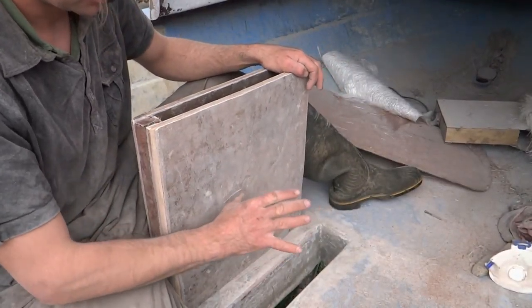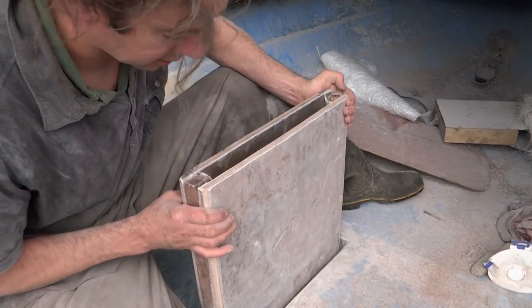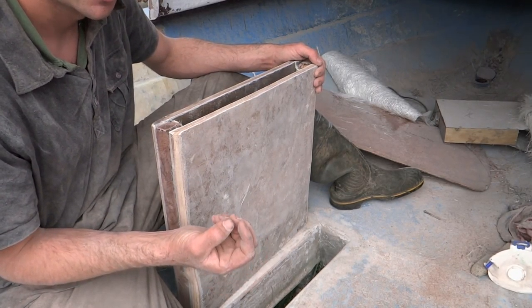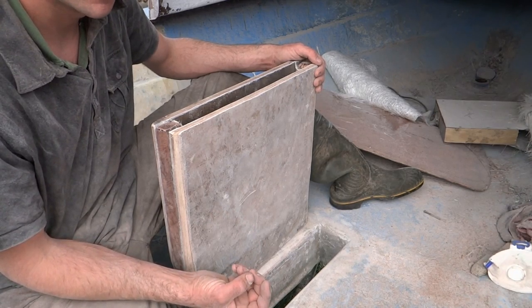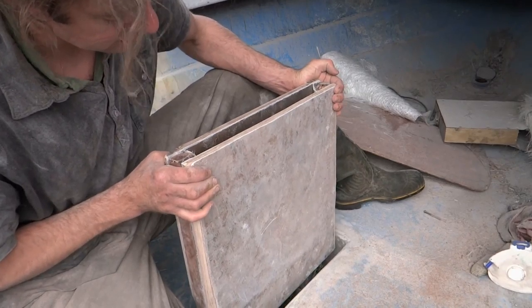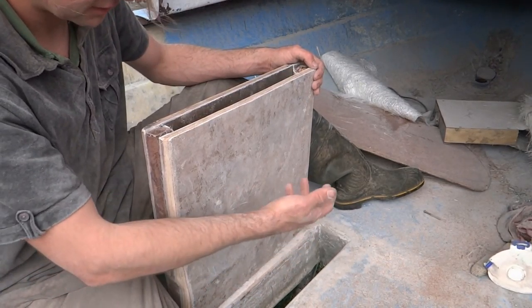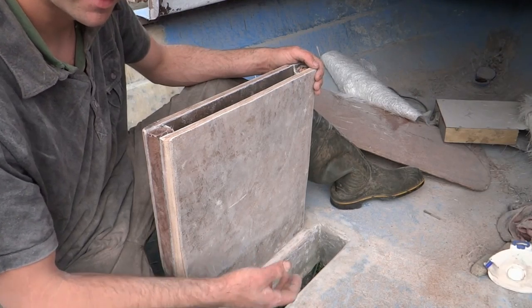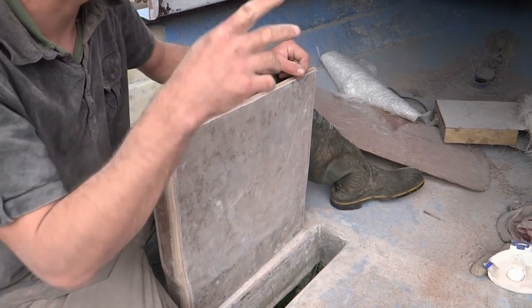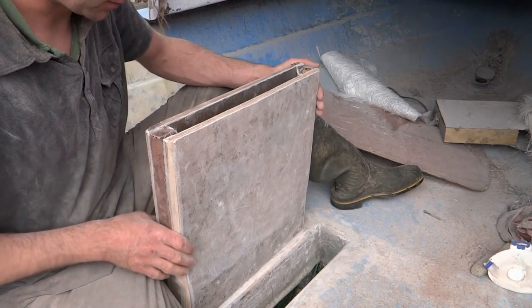I need to square it up, probably hold it on the top and then seal the bottom with one layer, then backfill. There's about a 12mm gap either side. I'm thinking of using syntactic foam — polyester resin with a glass sphere infill — to just seal that box up and cut that slot there. About 25 minutes. Then seal the deck to the outside of the box too, and do two or three layers underneath just to build it up and make a nice smooth profiled shape to slide in the water nicely. Then keel fixings. There should be less of a hole in the boat.